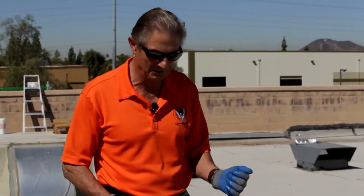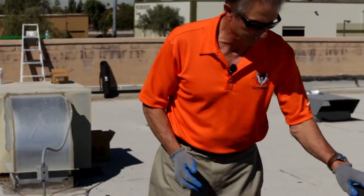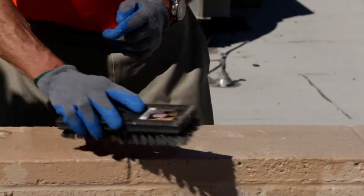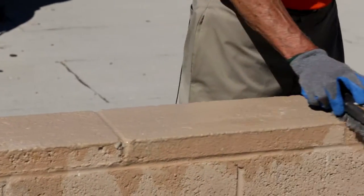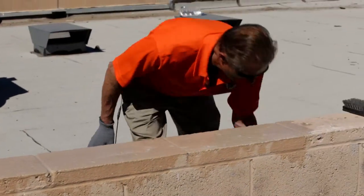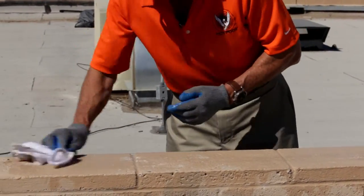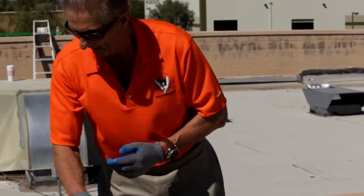This has been soaking for about two minutes. I have a common ordinary hand brush from a hardware store. We're going to brush these droppings and get this surface completely free of bird fecal matter. You can see as I'm doing this there's no dust blowing up, there's no fecal matter in my face — I am totally protected from any contamination. Having done that, a plain ordinary rag is good enough. Wipe it across the surface to clean off the excess liquid, then wait for this to dry and the surface will be ready to install our bird repellents.